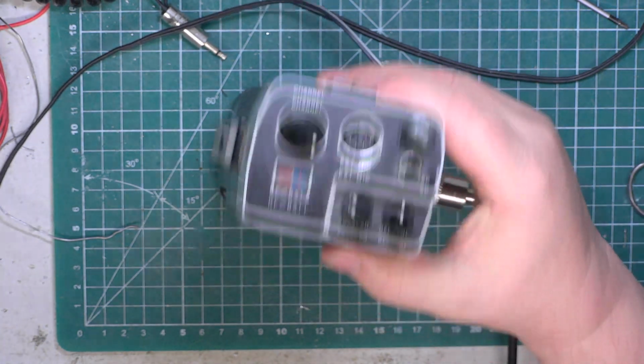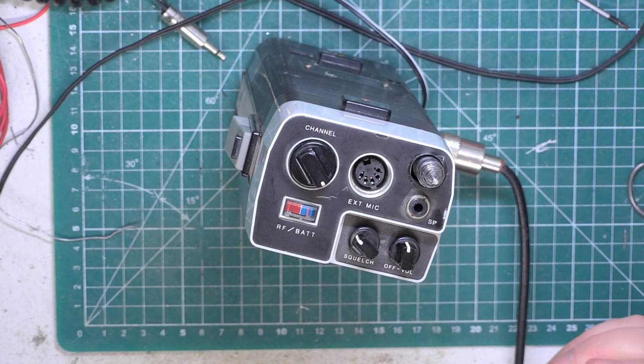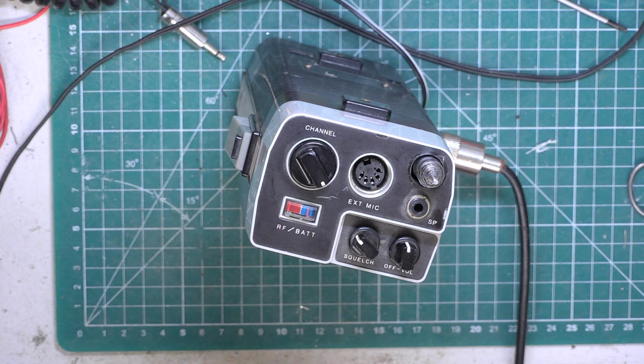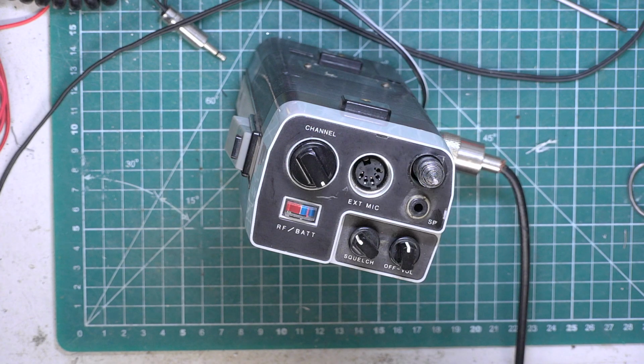So there we have it, another very nice realistic TRC1001. Supposed to be no receive, no transmit, and no squelch operation. I've gone through it for dry joints, but with it presenting itself in working order, that is a difficult task, because all I can do is to draw on experience and go through those plated through, not plated through interboard connectors. So we've had it on all day.